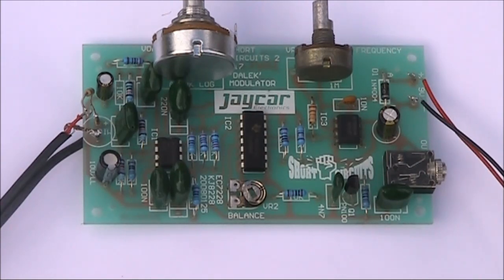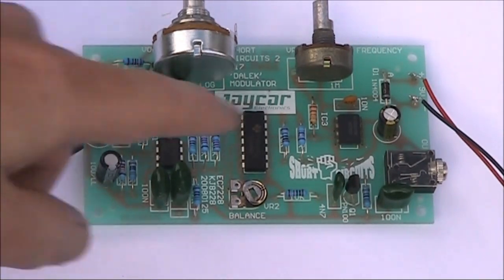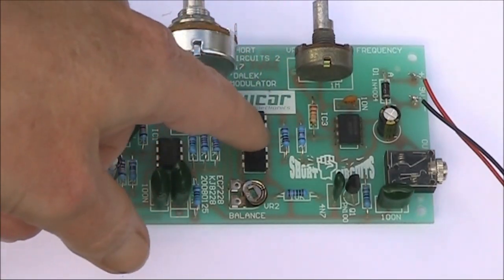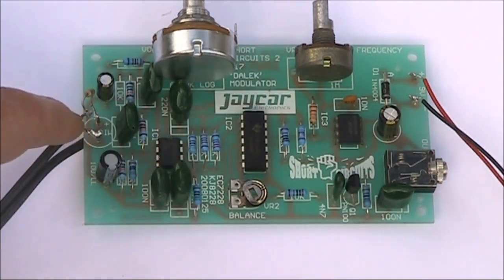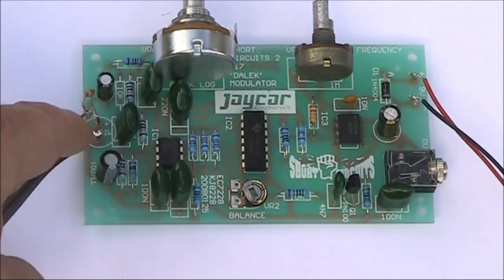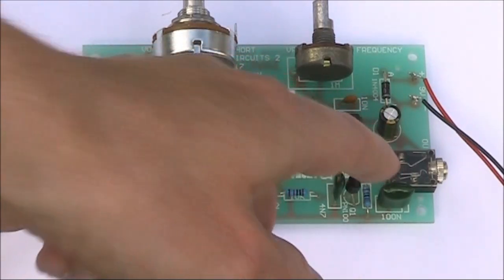The main stages on board include an audio preamp, a balance modulator, and a local oscillator. The sideband inverter had an audio signal coming in, being mixed with a signal around 3 kHz generated by the 555 local oscillator, and the output being an inverted version of the input. In other words, 2.5 kHz coming in mixed with 3 kHz gives 500 Hz, and conversely, 500 Hz coming in mixed with 3 kHz gives a difference of 2.5 kHz.